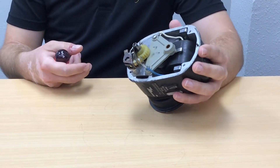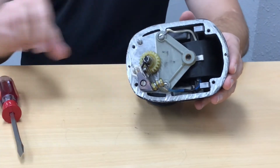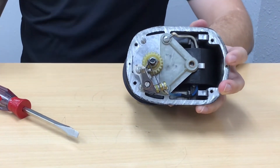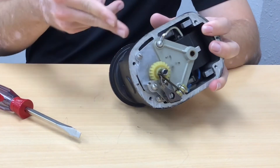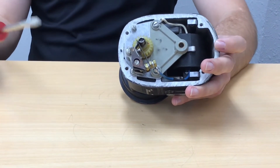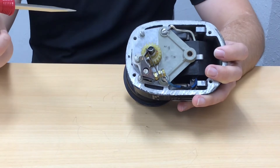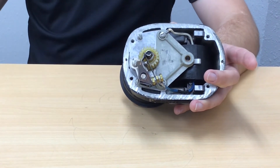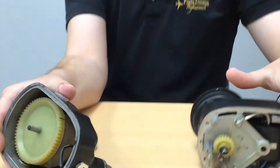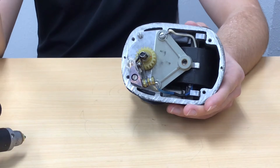The blue wire goes to a little tab and a cam in this little gear. The cam has two little lobes that spin as we turn the magneto, opening or closing what we call the breaker points. When the breaker points are opened by the cam, the flow of primary current is interrupted and the magnetic field collapses, generating a voltage spike of around 250 volts. This would be enough to arc across the breaker points and cause a less predictable, weaker spark. So there's a capacitor wired between the breaker points — you can see it on the exterior. It holds some of the charge and prevents arcing for a few microseconds until the breaker points are open far enough, so we get the spark exactly when we want it.